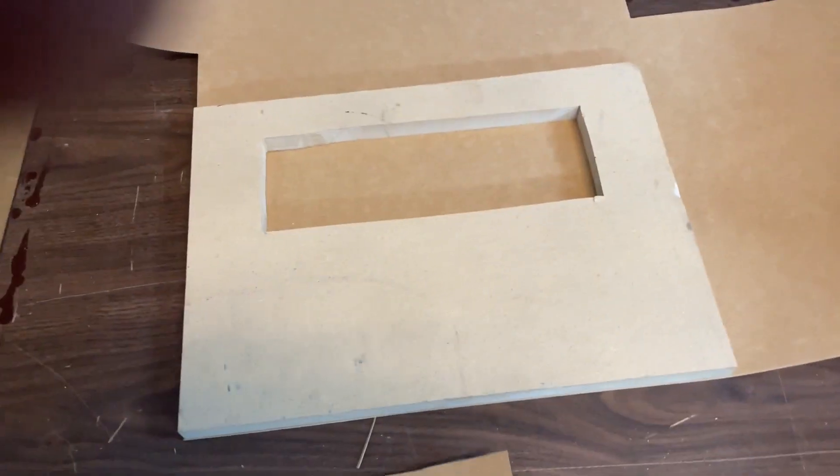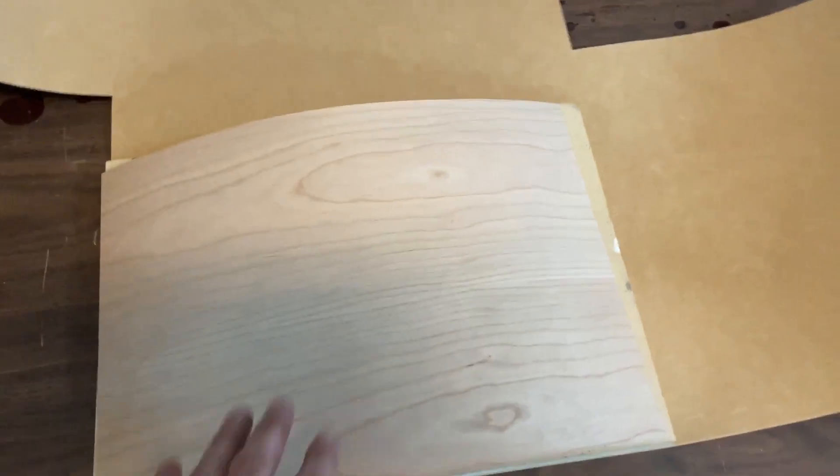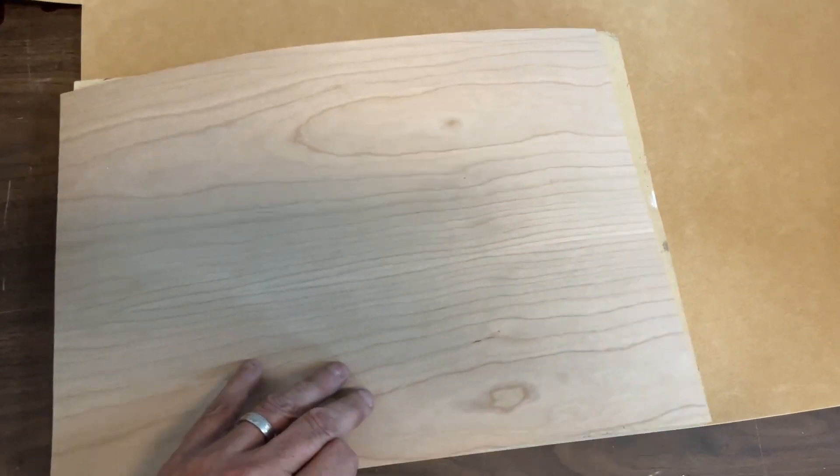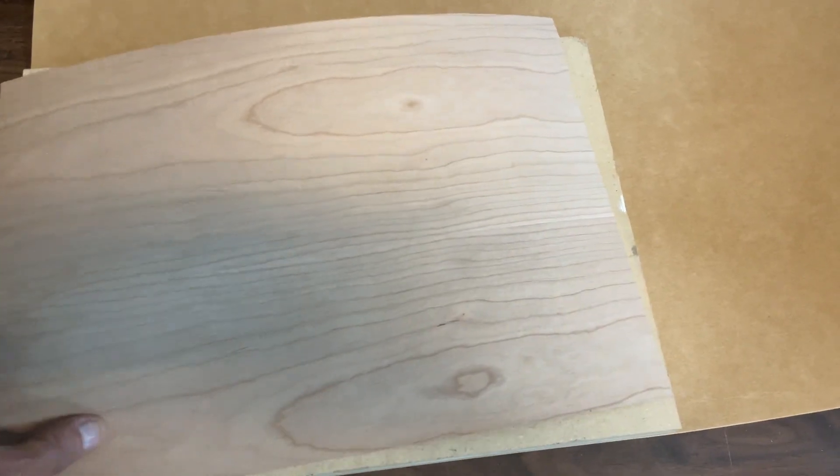I've already done this, and that's what this piece is. As I mentioned in part one, for the cutout, don't try and cut it out ahead of time — get your piece cut, get it glued down. This is why you don't mount the top piece yet on the box: you'll cut it from the underside.